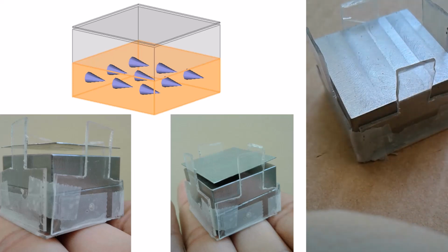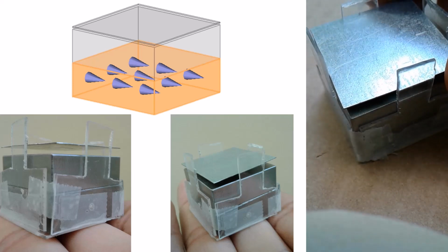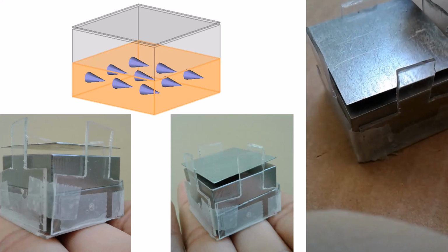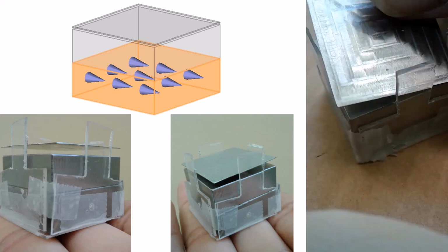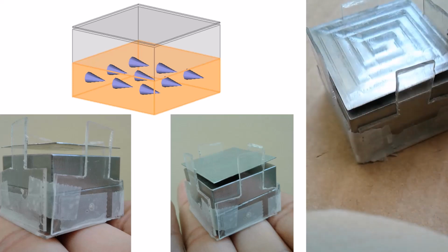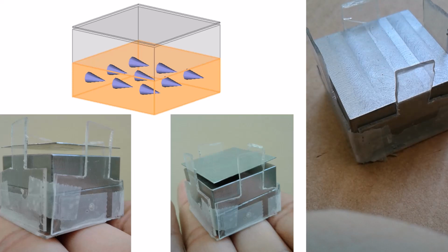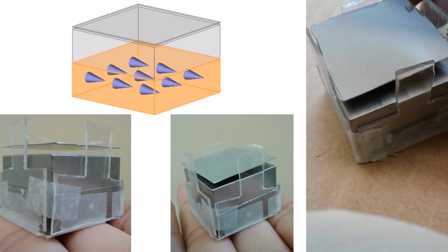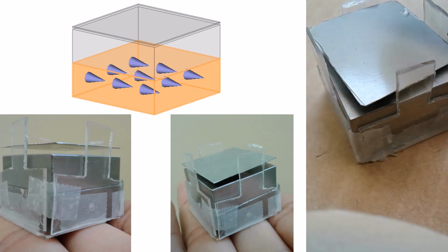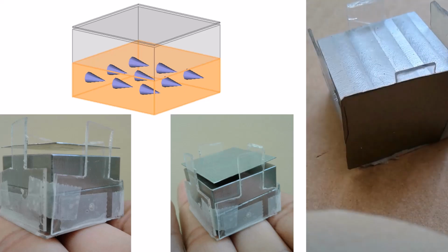When Bojang sent me the device, he also told me about a device called a sheet fanner. And a sheet fanner is used to separate the edge of a piece of steel from the top of a stack. The idea being that it's hard to pull the top sheet off a stack of steel, but if you put a magnet nearby, which creates magnetization parallel in the sheets of steel, they will repel each other, and if you do it right, you can get just the top edge to lift up so that the top sheet angles a little bit. And you'll see that kind of thing happening when a misalignment occurs.